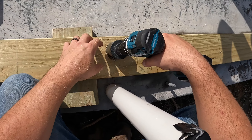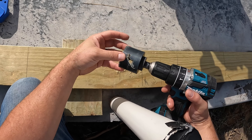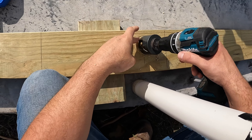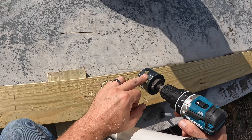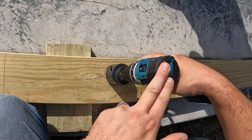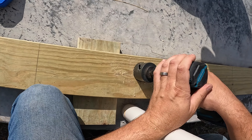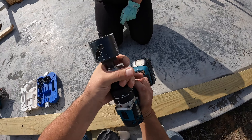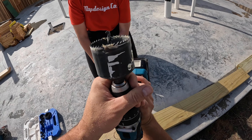I'm drilling the hole for the vent pipe for the utility room. It's a two and a half inch hole saw for a two and a half inch pipe, so it'll be just a little bit bigger in diameter because of the kerf and the offset teeth — that way it'll get around the tape and everything. You've got about a half inch of exposed drill bit to get right on your mark through the center hole, and that side hole is for prying the excess piece out. I put it on and then I don't go straight down — I kind of walk the blade in a clockwise motion, and back off every once in a while to clean the teeth out. Make sure it's tight.